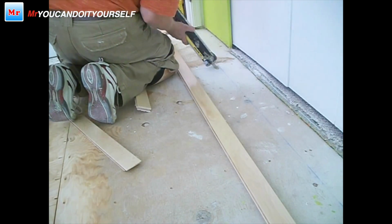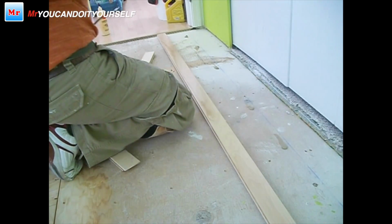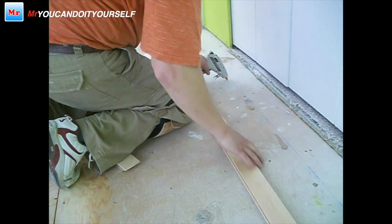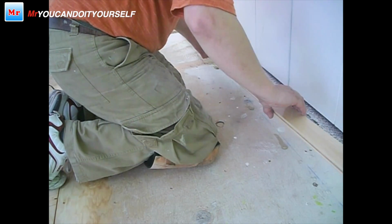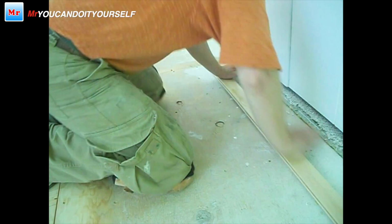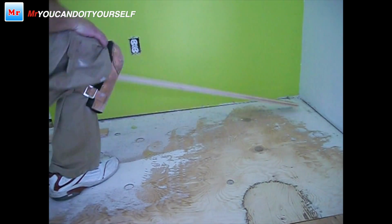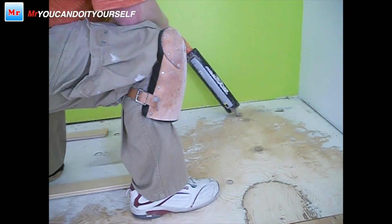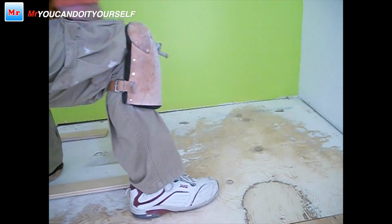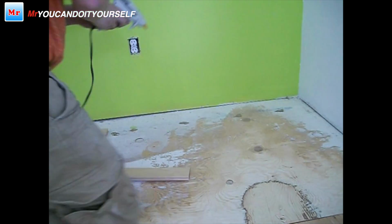So I didn't tell you about the straight line that I made from the existing floor. I just took a chalk line and transferred this line from the hallway to the master bedroom. Now I found one long board, put construction glue and hot glue and glued this long board to the subfloor, and another little piece to finish this line. Just a few drops of hot glue.